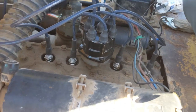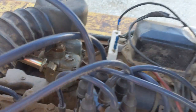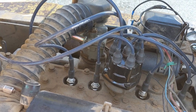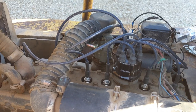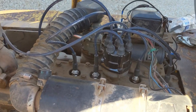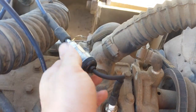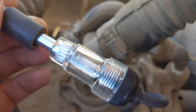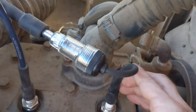The plugs, wires, cap, and rotor all look new, and the carb looks pretty clean. What happened was it was running good, the guy had the carburetor rebuilt because it started running a little poor. He said it was running great afterwards, but a friend told him to change the cap, rotor, plugs, and wires. He changed that and it hasn't run since — so more than likely he just did something wrong. The first thing I did was hook up this inline spark plug tester. There's a little light bulb in there, and when you crank it over, if the bulb flashes you know it's firing.